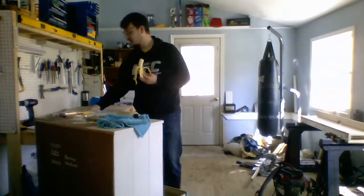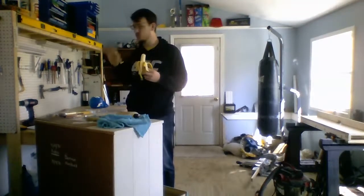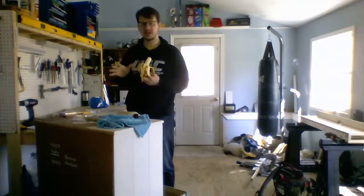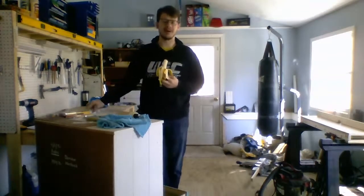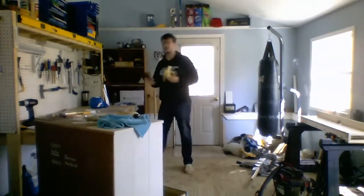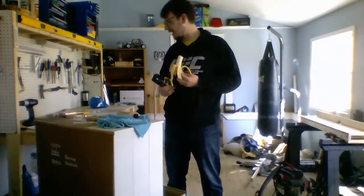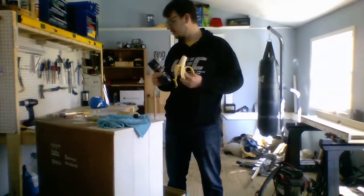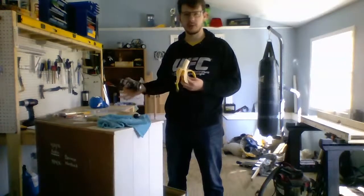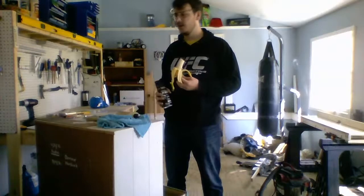I'm going for kind of a rustic, aged, distressed look, so I don't want a super pretty, clean polish, because I'm actually not even going to put a stain on the main box, the birch. I'm just going to apply some spray lacquer to it just to protect it. So since I'm not really going for a high finish on the box, I didn't think it made sense to put a really high glossy coat of paint on the posts either. So that's why I'm just going to go with the primer. It holds up very well.